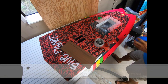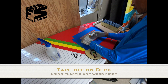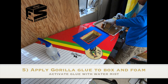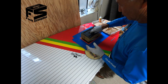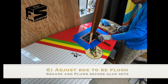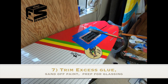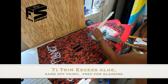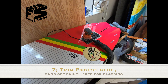Put the box in flush to the bottom and mark the top where it's going to fit. Then put a piece of wood and some plastic to cover the deck, apply gorilla glue to both the box and the board, and stick it in. Water activates the gorilla glue so you need to spray water when you do that. Make sure the box is in nice and flush, check it's square and plumb. When the gorilla glue sets up it fills all the voids and oozes out, so you cut away the excess — it oozes out quite a bit — until you have a nice flat surface.